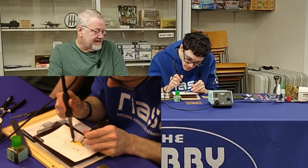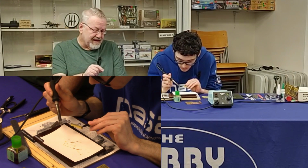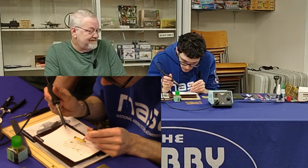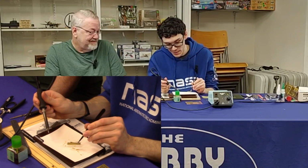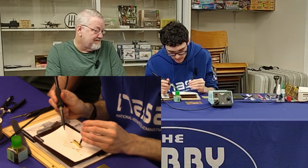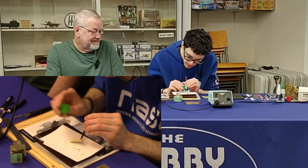And for more advanced techniques, I have actually simulated welds by overdoing solder on certain joints. And afterwards, with the iron, you can kind of stipple it as you're moving along, you can create an actual weld bead, because that's what it is. It's not great, but I can hold it together. Okay, yep. And now if you put more flux and run along the outside of the bead, that's when you recreate the visible part. Look over here. Yeah. Look at this spot here as well.